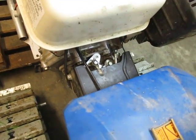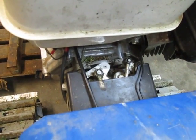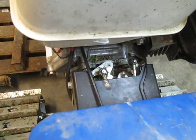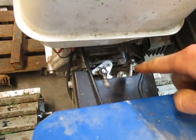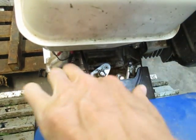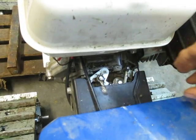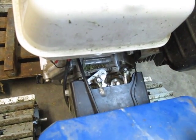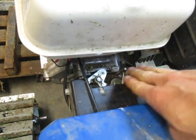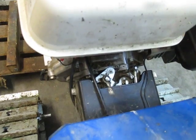I'm going to actuate the levers from the top end and explain what's happening. This lever that's moving now is the lower lever on the handlebar — the lower black lever. This one here is the red lever. The pivot points that these levers pivot on in the transmission are here — this bolt and this bolt directly down in here. Those are the axes that those levers pivot on. As you can see, if I start to pull this lever here, this cable anchor point is actually to the right side of this pivot point — so it's trying to pull this lever back this way, trying to turn it to the right.